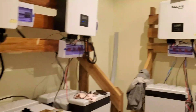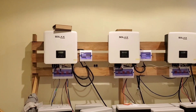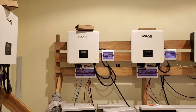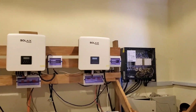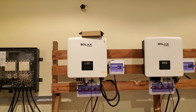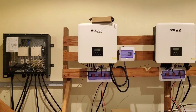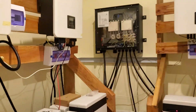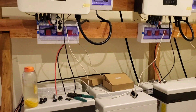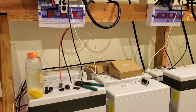It is looking good, we are tidying up. On Monday we want to run a minimum of 5 to 6 hours to simulate what it will be like with no sun and with sun. We saw some connections that were not supposed to be on the system — we had all the breakers inside the hotel off and saw about 10 kilowatts being sucked out of our system. We have spoken to people and they are removing illegal connections into the building, so that will resolve part of that issue. The water pump also is ahead of the hotel, so it is always connected to our system once our system is on.